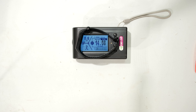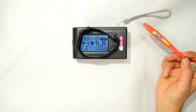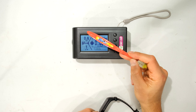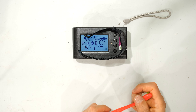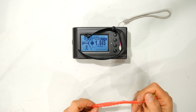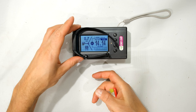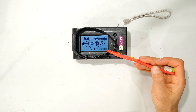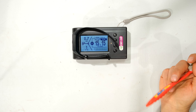Turning it that way, you can see we are picking up a high signal — coming in at 14. The RF antenna of this meter is sitting here, with antennas on both sides inside. If I put it on the other side it's far lower — 1.5, 2, less than 3 milliwatts per meter squared. But pulling it across to the other side, you can see it is significantly higher with a regular pulse at about 15 to 16 milliwatts per square meter.